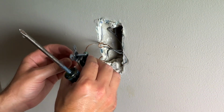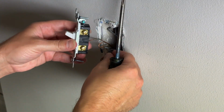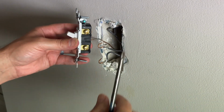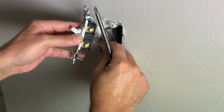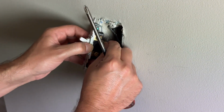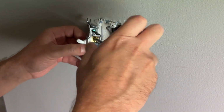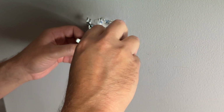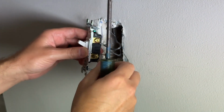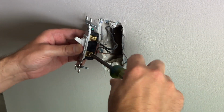And then you're going to put it back like you had it. I had to flip this one around, and then you'll grab these two wires as well and put those on the terminals. Doing the same thing, you want to hook them around in the clockwise pattern and then tighten them down. Once these things get tighter, everything will be nice and tight, because these will otherwise have the problem of falling off when you're trying to put everything back in there. So you want everything to be nice and tight, and hooked in around there.